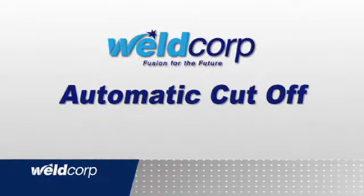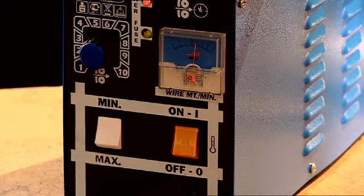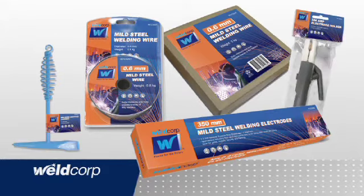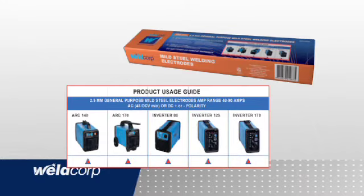An important point to remember is that all Weldcorp welders are fitted with a thermal overload protection, which protects the machine against burnout through overloading or extended use. The welder will automatically switch off when overheated and will reset when the welder has cooled down enough to continue welding. Weldcorp has a large range of wire, electrodes and accessories, so be sure to select the correct wire, electrode and accessory to suit your weld. Read the product specification and recommendations on the packaging. The information will guide you to the selection for your project.